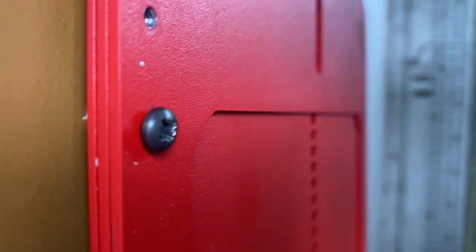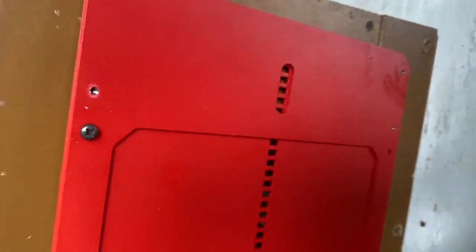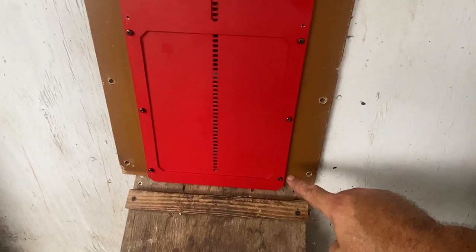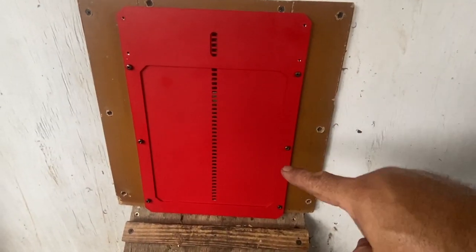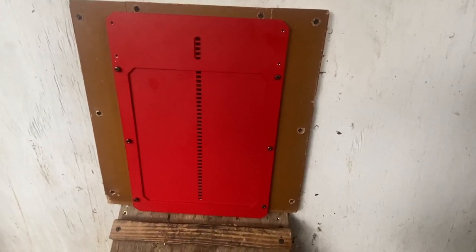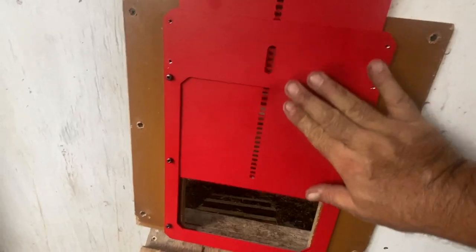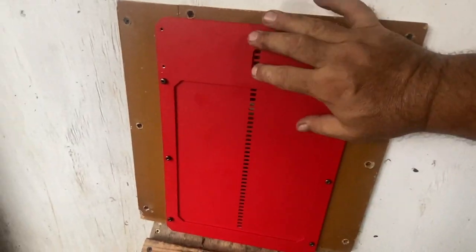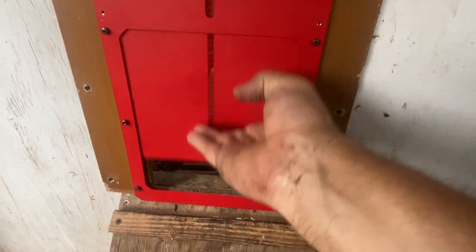And really, that's all it is. I've backed it out just a hair so it's not deflecting the frame and preventing the door from sliding up and down. The screws are installed — and I actually did drill pilot holes for these screws, and it was a heck of a lot easier. Drill pilot holes for your screws before installing. The door slides up and down readily, and with the gear in place, it'll lock it in place when it's down, so an animal can't come in and then lift it up.